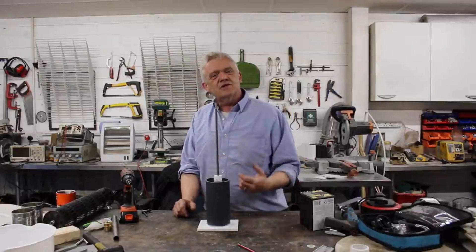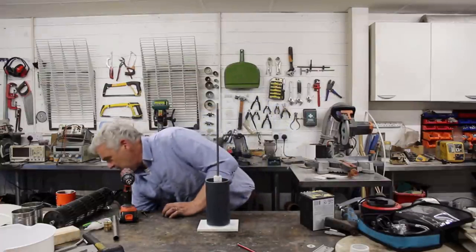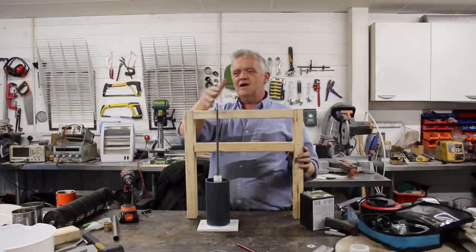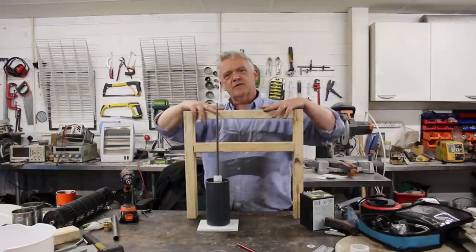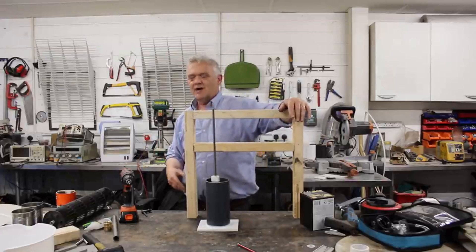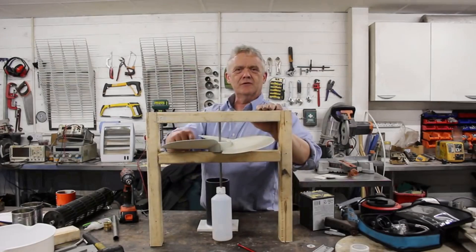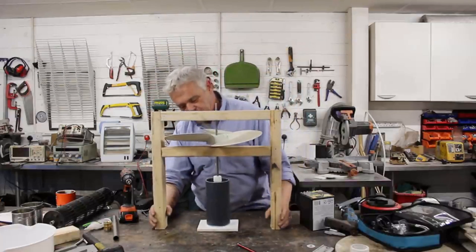If I were to do that I would have created a hydrostatic bearing, but it's going to wobble around like crazy because there's nothing to support it. So what I've got is a little H-frame. There are a couple of bearings in it in the center — those bearings don't support the weight at all. All they do is when it tries to wobble, they nudge it back into a center position. There's a big reduction of friction here because now it's being borne by water. I've got a fan blade, and I've shoved the bottle through the fan and through the H-support. If I drop the bottle in there, we're pretty much ready to go.